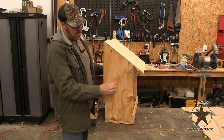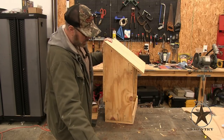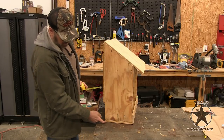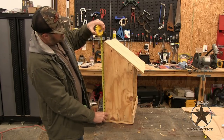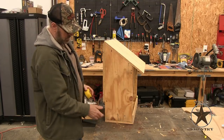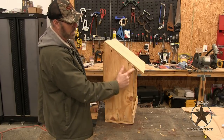This side piece right here — this is one piece — and that piece there is nine and a half inches. Not including the bottom piece, it should be two feet. Up to the very point, it's two feet. And that's just this piece, not including the lid or any of this. So it's nine and a half by 24 with a 35-degree angle.